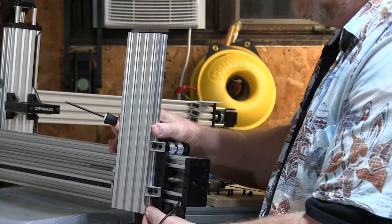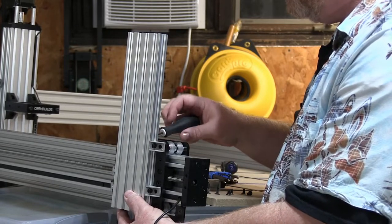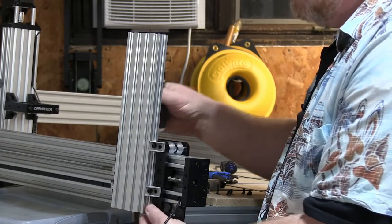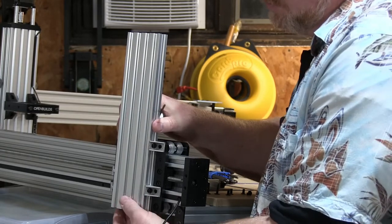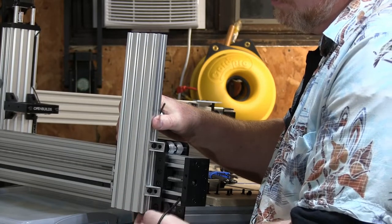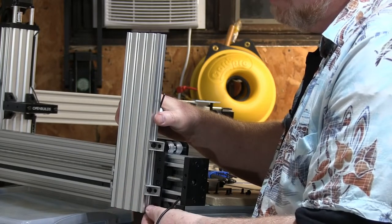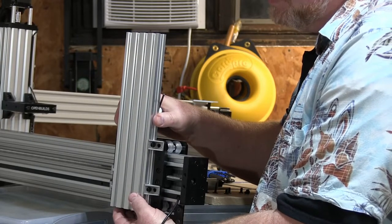Because when you first build it, you set this on a tabletop and it's easy. Here you have to kind of feel it with your fingers, lightly tighten those up and still leave enough give that you can adjust it up and down without it slopping back down again. This takes a little bit of fiddle. We'll talk more about adjusting the wheels on the bottom in a minute. It's a really good time to do that when you get it up after you've made a mistake like I did. Okay, so I've got this adjusted so I'm not feeling a stair step either direction